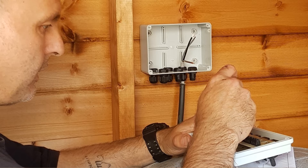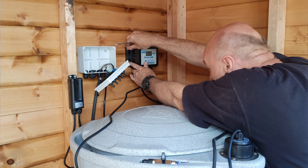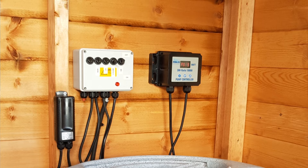I ran it into a 5-gang switcher box in the filter house. I also installed a twin 3-pin waterproof socket inside for the pond vacuum, jet wash, and things like that. I fitted a 10,000-litre-per-hour variable pump — the Aquaforte DM Vario. I highly recommend a variable pump and the Aquaforte in particular — I've had no problems with it at all. It gives you so much control over the flow into your pond and through your filters. I wish I'd fitted one on the skimmer as well; I just fitted a basic 10,000-litre pump on that one and it wasn't variable.